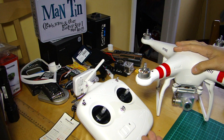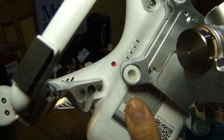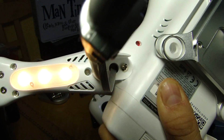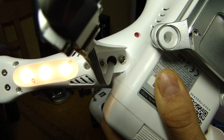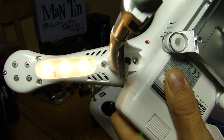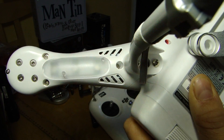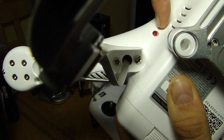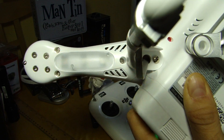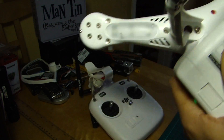So let's show you how to do that — we'll need to go for a close-up. Now, with props removed — safety first — and transmitter off, I've switched on the aircraft. What we're getting is the usual yellow rapid blinks meaning it can't see a transmitter and isn't bound to anything, and we've also got this blinking red light here. That's actually the receiver, and that is also saying it's not bound to anything.